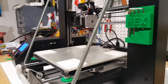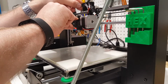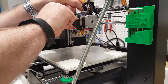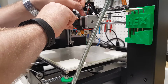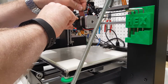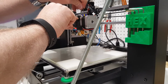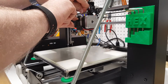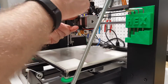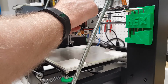So I'm going to take a quick minute and empty out the rest of the filament by pushing my favorite key through. And this is going to get really hot really fast, so we'll try to be quick about this. It's always a matter of just kind of getting the key on the end there that you're pressing directly down on the filament. Now we are preheated to 250, so this should be going through like butter. And it pretty much is. There we go.